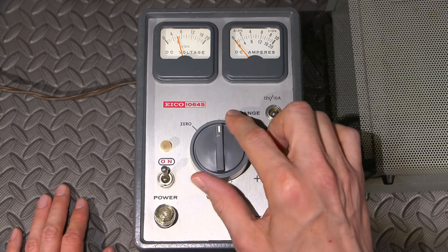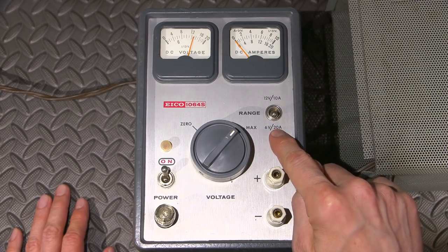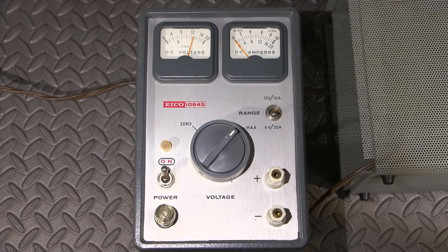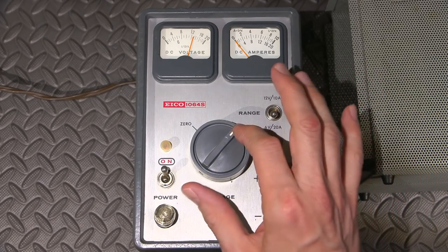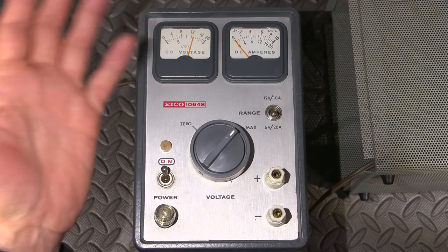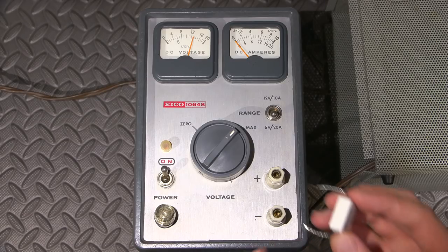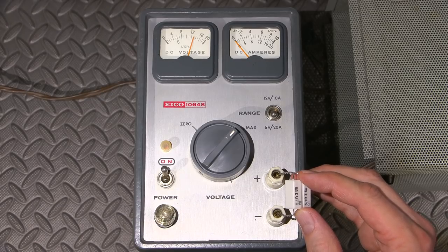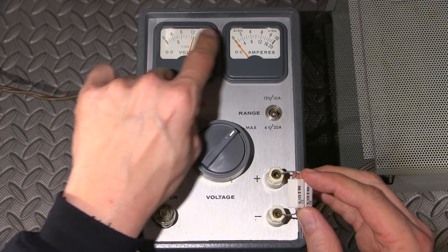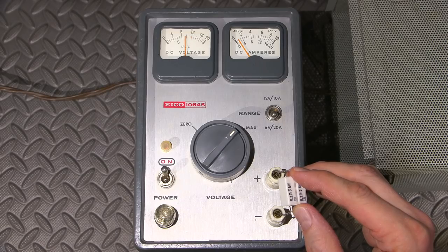There's the 6 volts. But I can turn this right up to 13 volts and it still says 6 volts - is that normal? Absolutely, because you are the regulator. There is no load on this thing, so it's just free floating - the transformer isn't loaded. If I add a load - I have these two resistors paralleled here from a recent power supply demonstration - I'll add them to the binding posts. Look at that - wait 10 seconds for the bouncy needle to settle down.